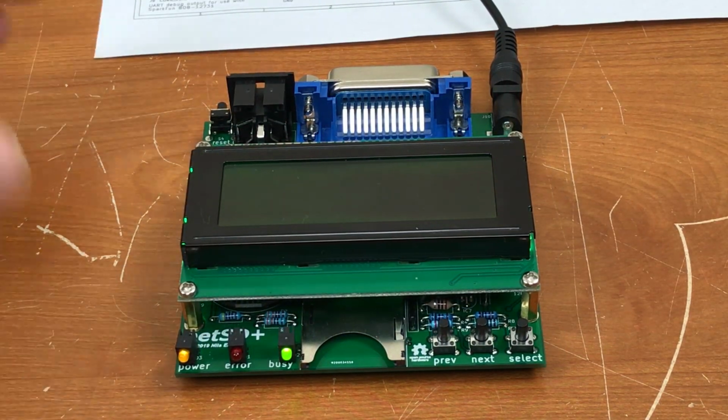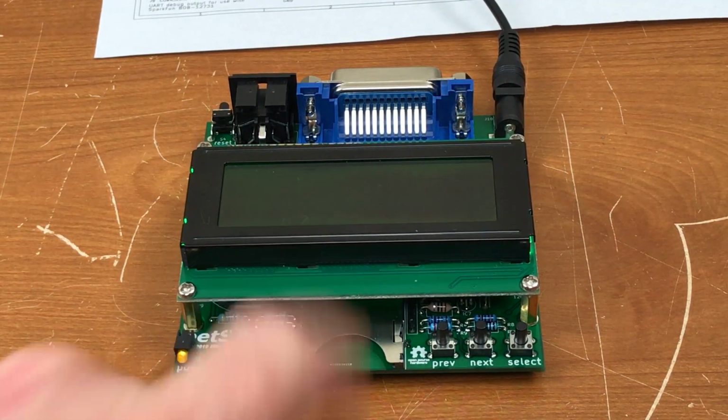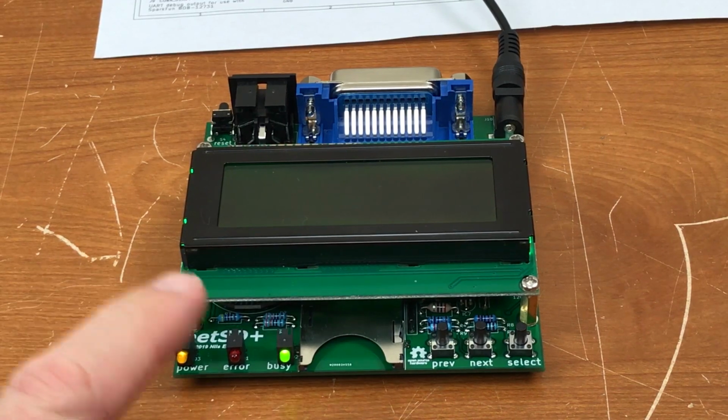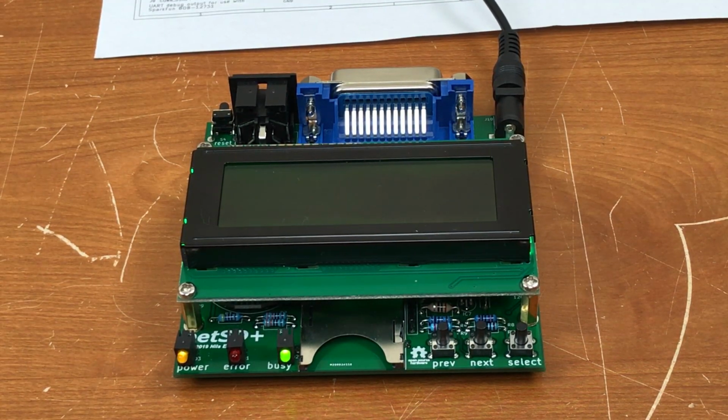This is what was happening. On power on or reset, you get the lights flashing in this pattern and the display never comes on. I emailed Dave at primrosebank.net back and forth a few times, and he figured out that when it does this, it indicates that the bootloader is running and attempting to start the application but failing, or the application is starting and crashing before it initializes the display. He's not sure if this is a problem with the firmware or maybe a problem with component tolerances.